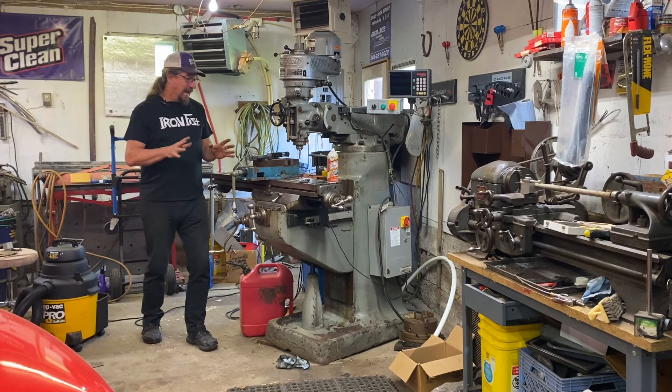The tool feed is just a little fast but pretty good considering what this thing is. We could slow that tool feed down and get rid of that little bit of threading it's leaving. Not bad at all — that'll do. Works much better, really happy with it. Thanks Chris.